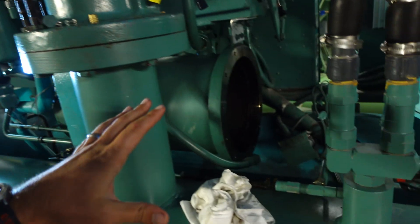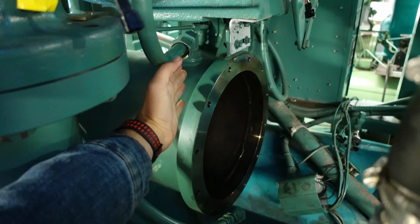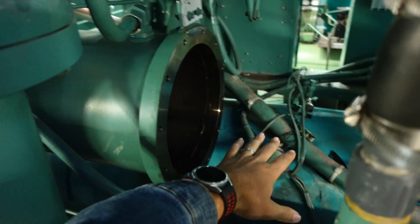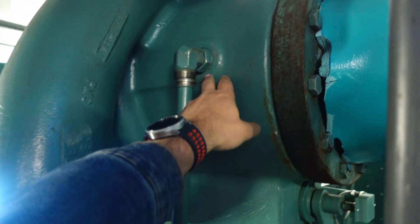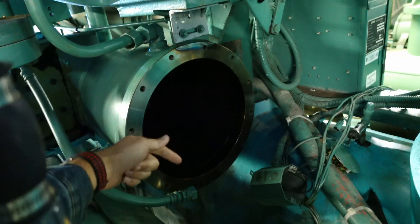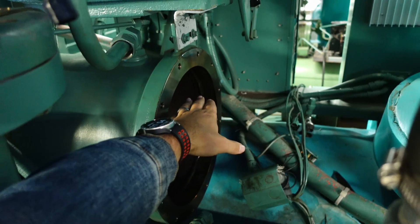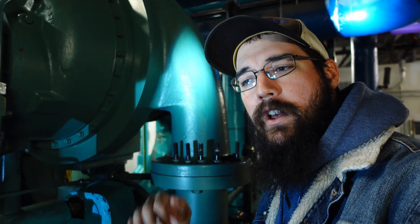Some other things we need to discuss: this is your vapor vent pulling off of the tank. Being the fact this is exposed to refrigerant, you're going to have some refrigerant exposure in general and we really don't want that refrigerant stacking to make this tank higher pressure than our evaporator side of the system. This tank should be in a lower pressure state. One of the ways we're able to do that is we pull the vapor directly into the suction nose of the compressor so that it constantly has direct pull — this helps keep any flashing vapors in the oil pulled off of the tank. The oil pump itself constantly drawing down also helps maintain a lower pressure on this tank assembly, so the sump pressure will be slightly less than your evaporator, which goes a really long way in helping your oil return process and its ability to come back through the drain port into the sump.